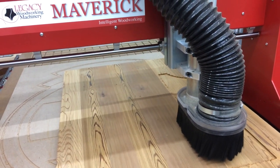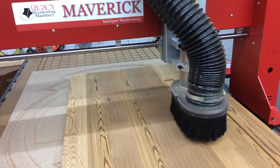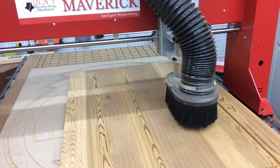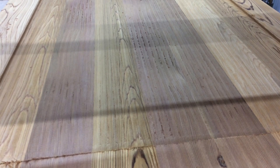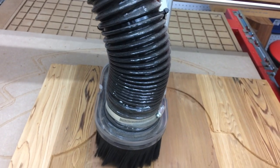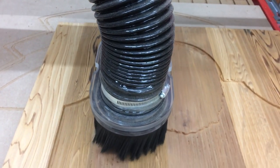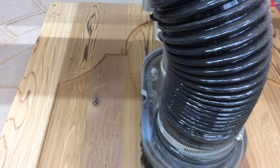The recessing didn't take long — basically just running the program, about the same time as surface planing. An end mill creates this recessed area for the sign. Here's what it looks like on the half-inch end mill pass. Then I moved to the quarter-inch end mill because it couldn't get into some of those areas at the top of the sign.